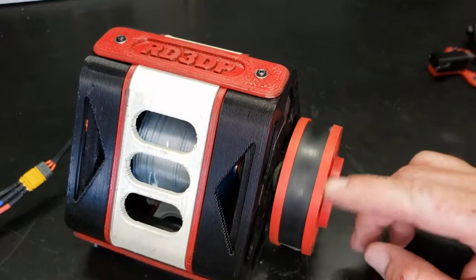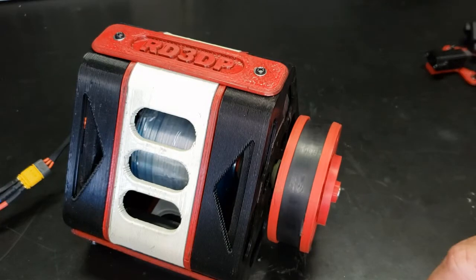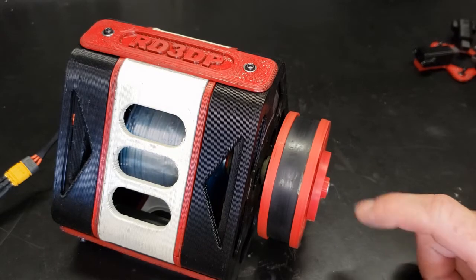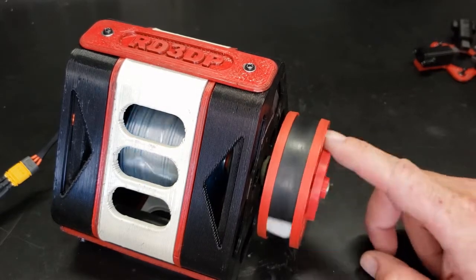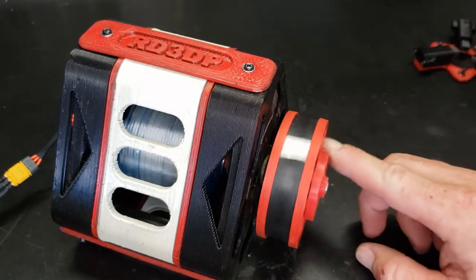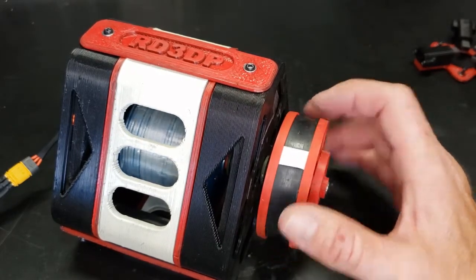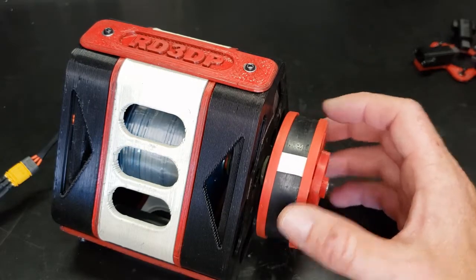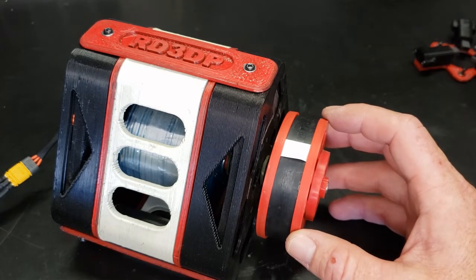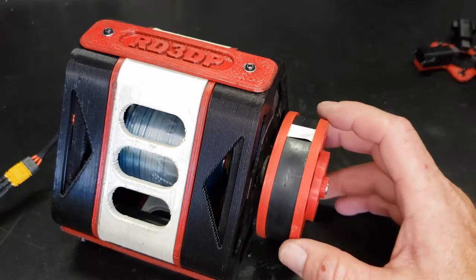So this motor is basically just three coils spaced at 120 degrees apart. Each coil is wrapped with 19 gauge American wire gauge magnet wire, 40 turns, and 1 ohm each. This is a flywheel. I don't even know where I found it. It's just a round piece of steel that I painted black, and I printed a little container for it to evenly space it on the rotor shaft so that it's nice and smooth when it rotates, not a lot of vibration.